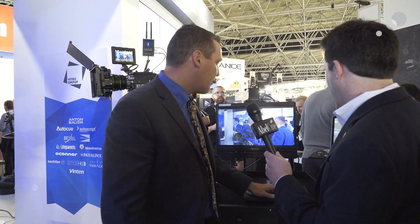You can talk to many different devices, bolts, and other things. So for example, I can now come up with a look in real time, and the moment I hit apply, it's sent over wireless to this device, which can then send it to all the devices on set. But in doing that, it has to actually create a new custom LUT for each chain, because each camera and each monitor is going to look slightly different. So this will actually take the camera characteristics, the monitor characteristics, and the creative characteristics and combine them into a new LUT and sync it across the set.